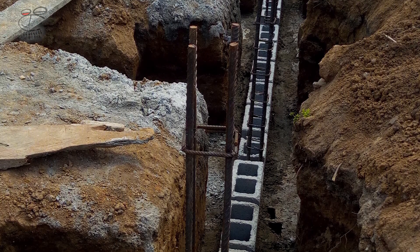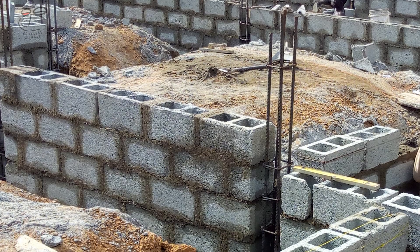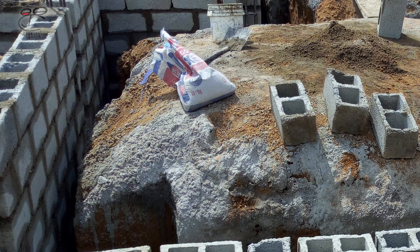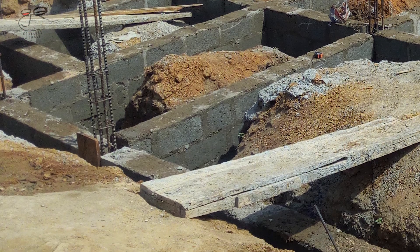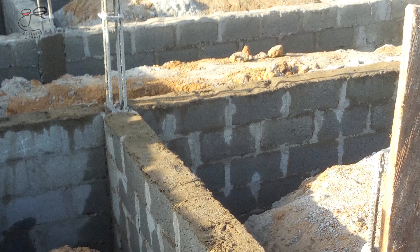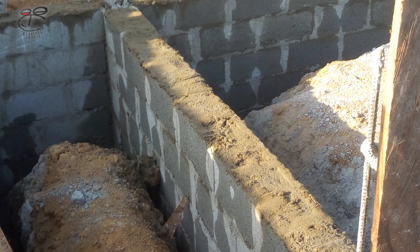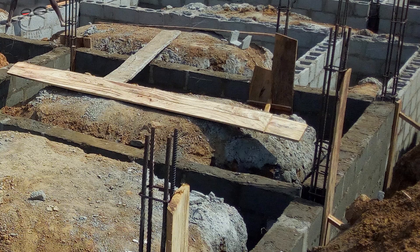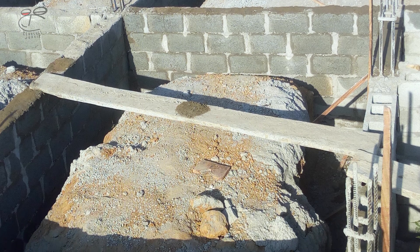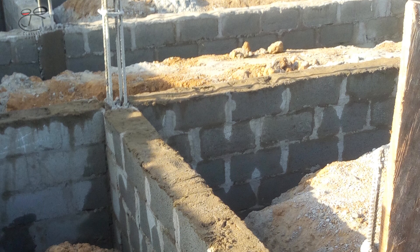After forming has been done, the foundation walls are built up. The block work leveling is done to a level above the natural ground level or as proposed in the building plans. The holes are casted with a plain mix of concrete. Using hollow blocks doesn't really compromise the integrity of the foundation walls, as the blocks are of high grade concrete and are also casted solid, so there is no dissimilarity in the long run.